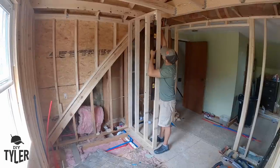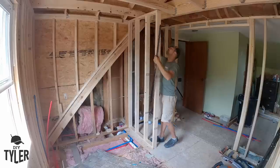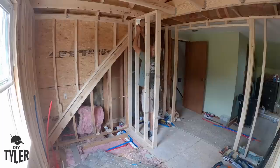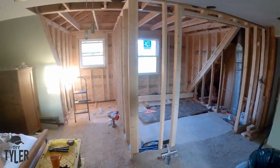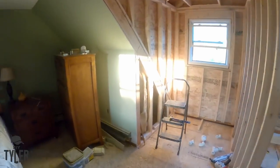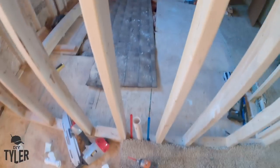I'll have a video specifically for that pocket door because those are slightly tricky to install but very nice to have. I'm making sure everything is super square in this room because I'm going to be the one doing the tile and I want it to be a spectacular job. Everything was really, really square from the rough framing that Gerard did — very pleased. Here's a panning shot of the space with the interior framing done. We have the current bedroom here, and this is the new bathroom with the plumbing running underneath the floor and popping up where the sink is going to go.